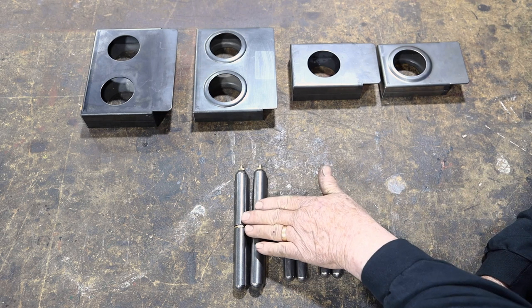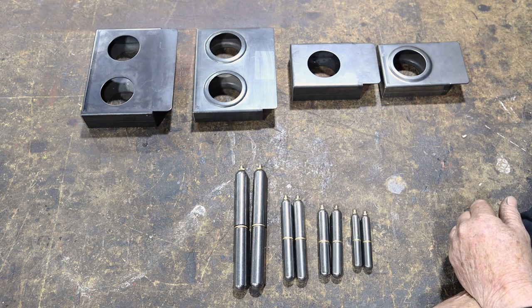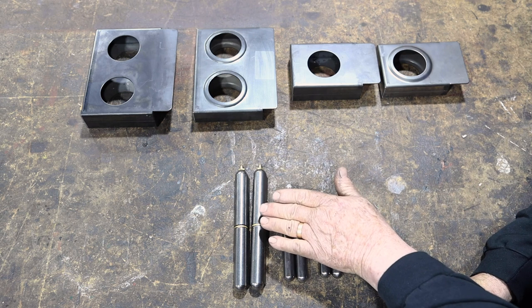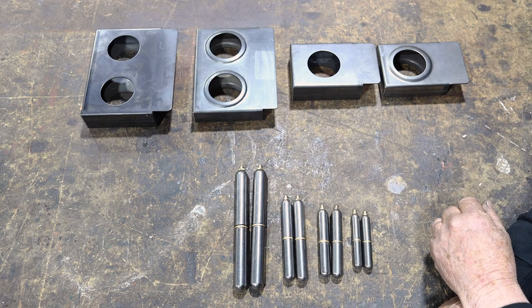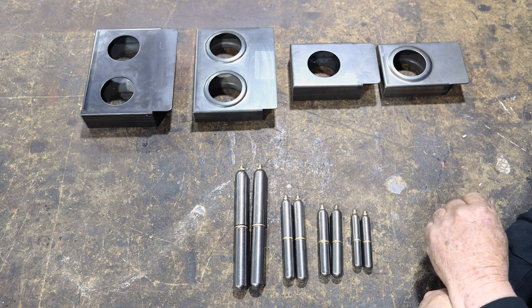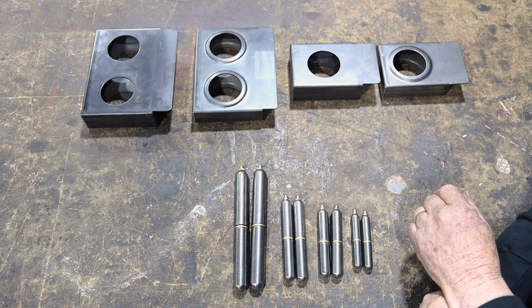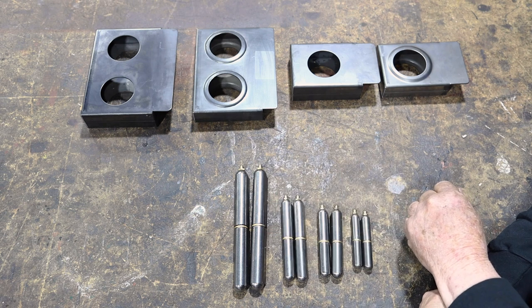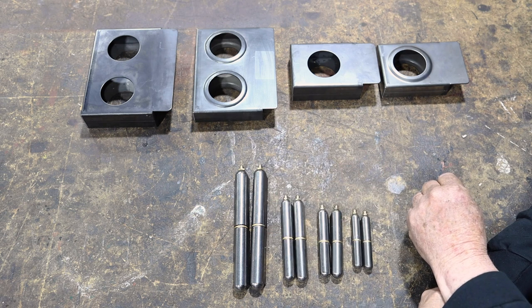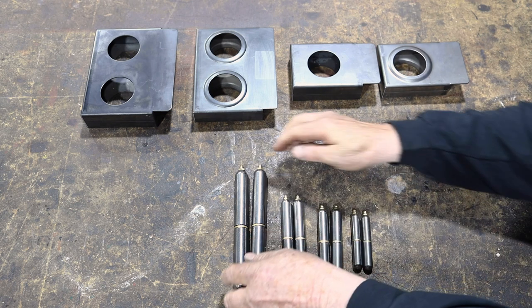And of course the bigger ones — this is a seven-inch hinge right here, and it has about an 850-pound capacity. This is the size I'm using on the gate over there. That's a heavy gate; the particular wood I'm using is tiger wood, which is a really heavy type of wood, and the gate itself is fairly large. So I want a larger hinge that's going to support that weight, and that's what I've used on that particular gate.